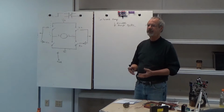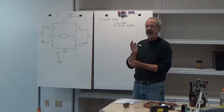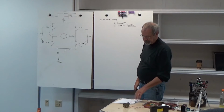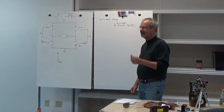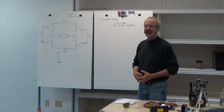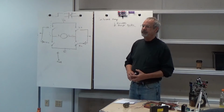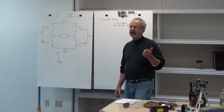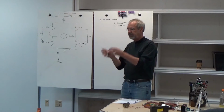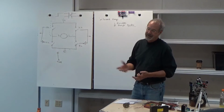Generally, in everything that's running in the robot, if you can do everything at a constant rate, a constant sample rate, a constant control rate, that makes everything easy. So you have to do it periodically, and as precisely periodically as you can. Now, what is that period? A lot of that depends on what you're trying to do and what the specs of the encoder are. But let's take a simple example. Let's suppose our update rate, where the robot reads its input, does some calculation, and writes its output, is 10 hertz to make the math easy.